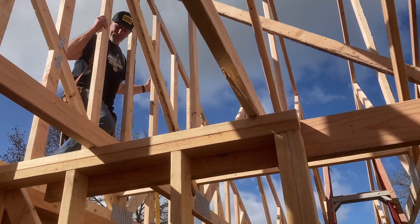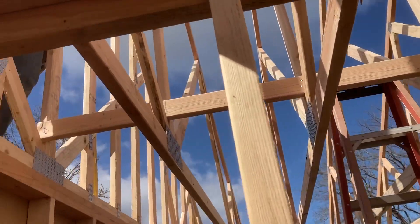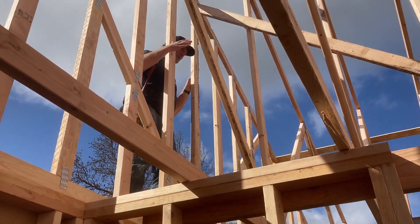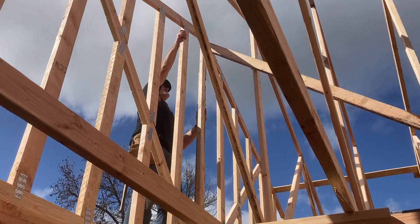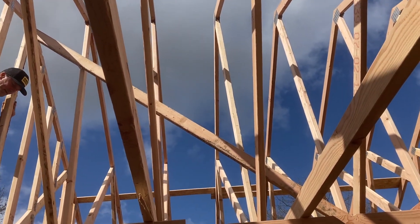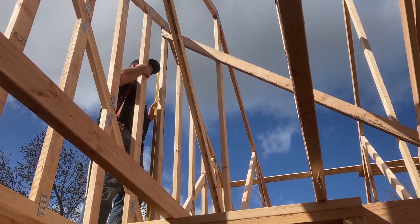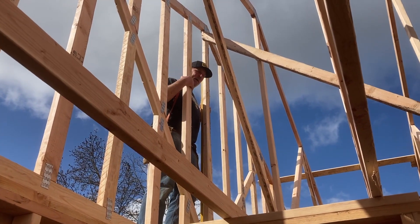We need a board across the bottom, but we're trying to create triangles just like the trusses. If we don't have a triangle, it's not strong — that's the whole idea with these angled braces. You can't squish a triangle unless something breaks, creating all this shear with triangles. This thing is now beefy. Why is it not moving? It's tied to that board that runs end to end, and down at the bottom it's braced. When the entire roof is sheeted, the sheeting becomes the member keeping it where it needs to be — the sheets are all nailed, it's a diaphragm, it all has to move together.